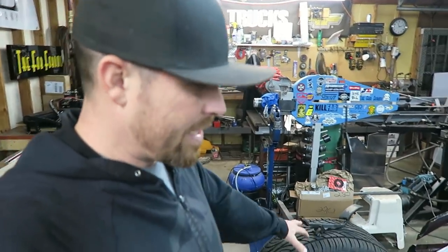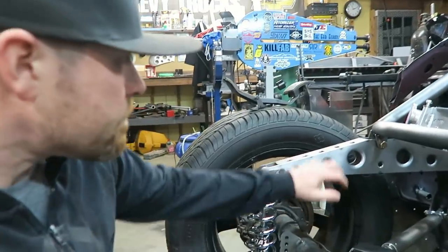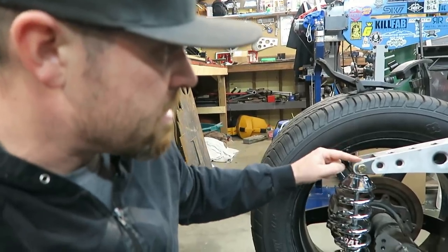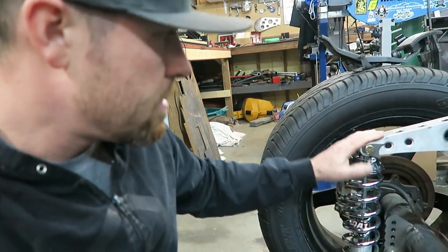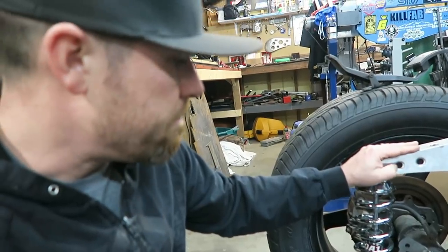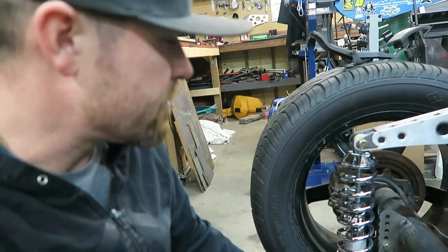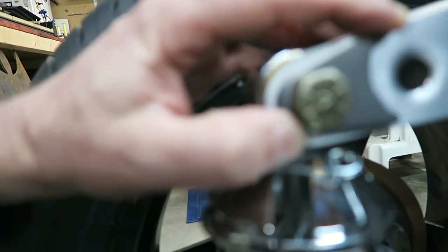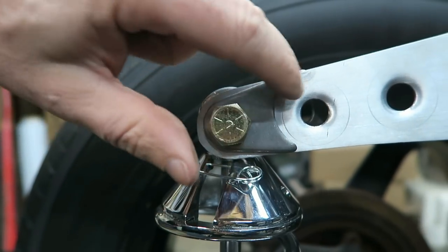So back when I did the cantilever video, there was a lot of concerns, period. One of them was that this 1/8 inch sheet metal plate steel wouldn't be strong enough to hold this, from wearing out, I guess, is what the concern was. A lot of these brackets, this bracket down here might be, what, 3/16 or something? Anyway, I think the fix to that is to just add another piece in here. And actually, this arc matches that hole pretty good.